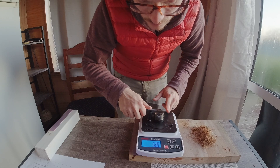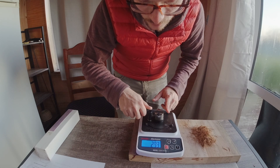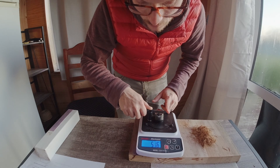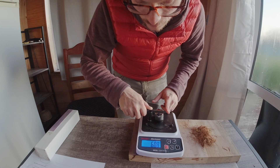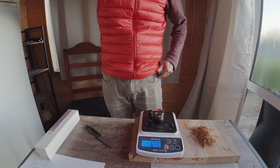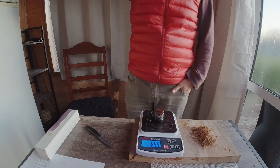I'm guessing the edge is still going to be relatively fine, like in the 300s, but I think it's just rounded over. Wow, that edge is gone — 659. It didn't even make it through the rope. That is astoundingly different. Guys, that is astoundingly different than like the Spyderco Ultra Fine. You could put the same style of edge on two Victorinox knives — Spyderco Ultra Fine versus lapping film — using edge trailing strokes, really gentle, and they would feel really similar. They would both split a hair.